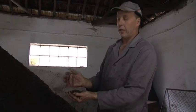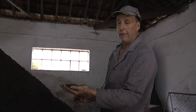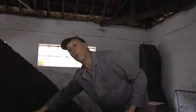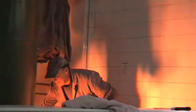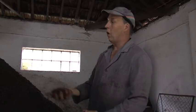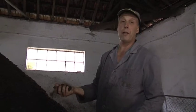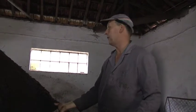It's a green power station, and they grind this a bit finer, just add it with ordinary air and create a 4 megawatt power station. But this is a very high, in relative terms, oil product, and it's a very, very intense heat burn. There's almost no ash at all. Of a whole day running our boiler in there, we may only have a half bucket full. It really burns to nothing and is a tremendous calorific. It produces an enormous amount of energy.